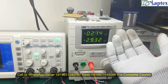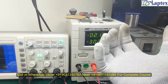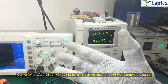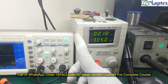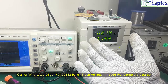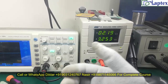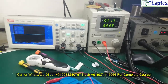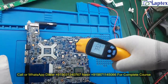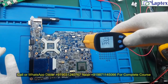All the electrons in the motherboard are flowing to that faulty point looking for holes, and that point will generate abnormal heat because all the current is concentrating there. Now you have to find that point using a temperature sensor, or you can touch it by hand. Let me switch it to degree mode — the ambient temperature here is 34 degrees Celsius in India.